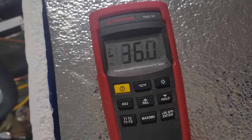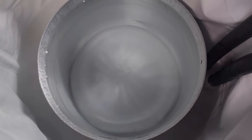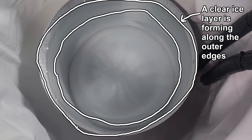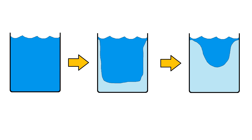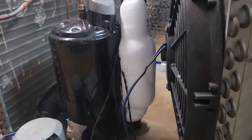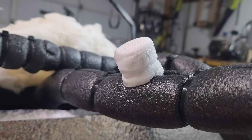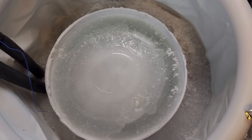After a couple of hours, the temperature near the coils had dropped to minus 36°C, with ice forming in the bottom of the pot and almost perfectly clear ice forming on the sides. It appeared to be freezing in a U-shaped pattern. By this time propane pressure had dropped quite a bit, and the compressors had gotten cold enough that vapor was freezing the outside of the liquid traps and the throttle valve had completely iced up. After just under 24 hours, the whole system was frozen, including the calcium chloride solution in the cooling bath.